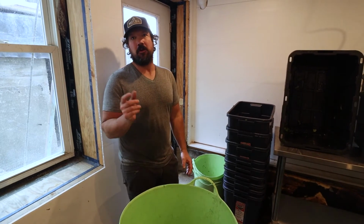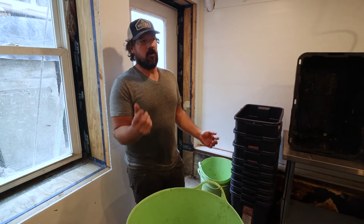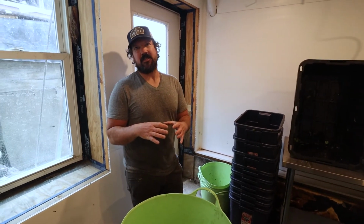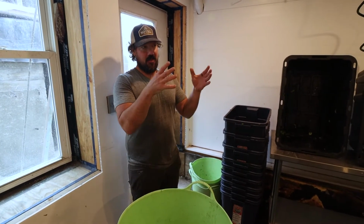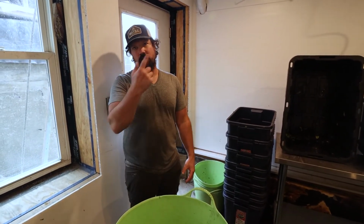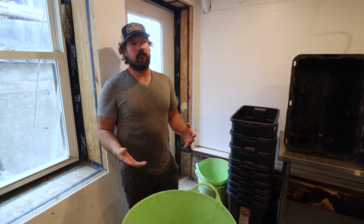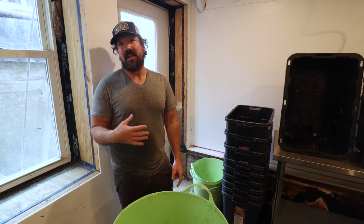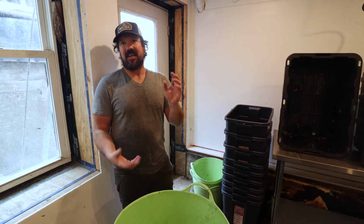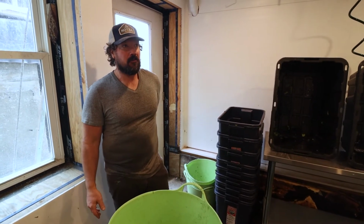And we deal with moisture in this building, which is a super insulated, air sealed building, by having the 3rd story window open about the same amount as the airflow of our 2 4-inch floor drains. So we open it the same amount and we have fresh air coming in through the floor drains, which go to daylight, and that's replacing the moist air, which is going up. It's not perfectly efficient, but because the spacing is the same, even on the 3rd floor it doesn't feel cold, even if it's -10 out in the middle of winter, because you're getting an exact air exchange and not a draft running through. So that works really well.